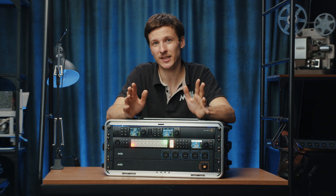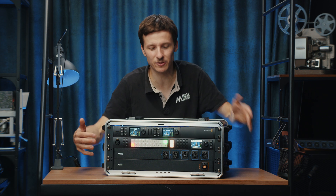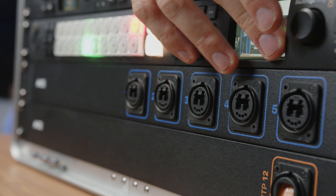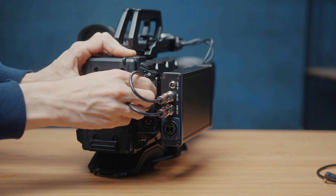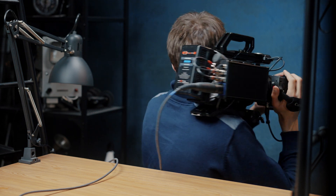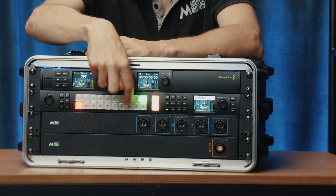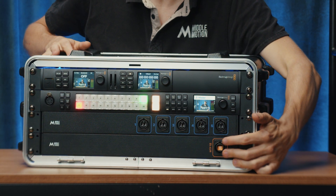What's very unique about this rack is that it has 10 video inputs and 10 video outputs over fiber in that little form factor. It uses products that we make here — the Fiber Dispatch 5, which has five fiber connections. On each fiber connection you have video in and video out, so you can have an Ursa broadcast with the video signal coming in. We can send the program to the camera with tally, intercom, and camera control.